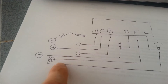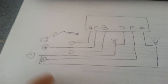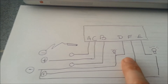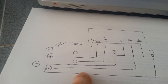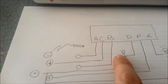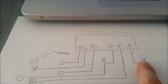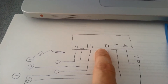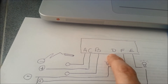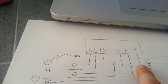I then wire up these other three connections as well. I'm going to use a 12-volt supply — at the moment I've got the DC output on the same controller. I set up my common coming in to connection F on the point motor, and I set up the other wire, which for me is going to be negative, into a light bulb on both sides. I take D to the other connection on one light bulb and likewise E. As the point motor swings left, a little washer under the point motor connects F and D, so the circuit is created and this light bulb goes on. If the point motor goes right, the connection is made between F and E and this light bulb goes on.